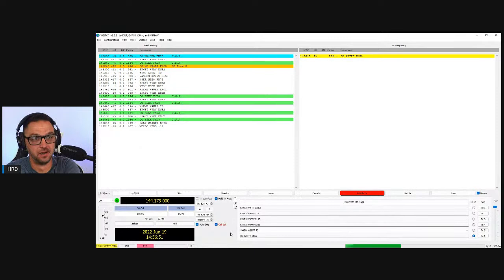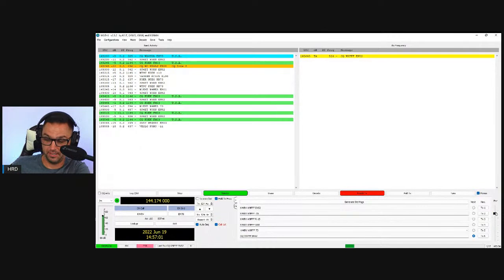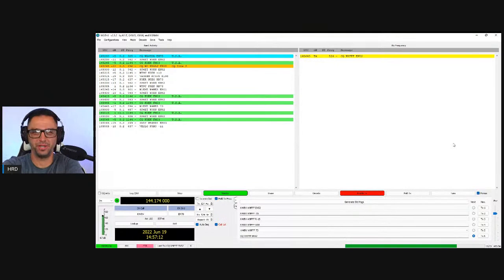And I know there's a lot of noise here. Oh, my ALC is a little bit high. So it's always good to check your ALC too. I'm going to bring that down a little bit here so my ALC is okay. And then I'm going to check my power level. Basically, if you're running high ALC, what's happening is you're distorting your signal that goes out. So it could create some issues and you might not be heard as well, right?